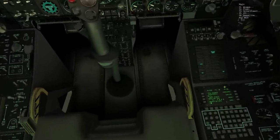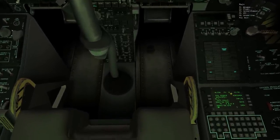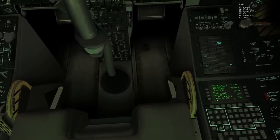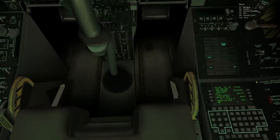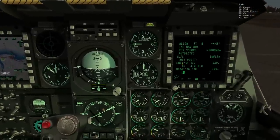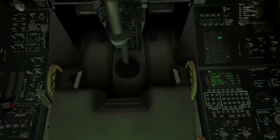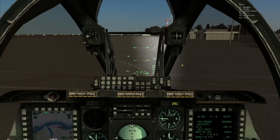Looking at the CDU, you can see it is flashing — that flashing means the INS system is fully aligned. The EGI we turned on is an integrated system that needs to fully align before you move. If you do move, you'll have to realign either in flight or on the ground. The key to look at here is T equals 4.0, 0.8 — that is your rate of error and that's as good as it gets. You have to wait for that before moving.